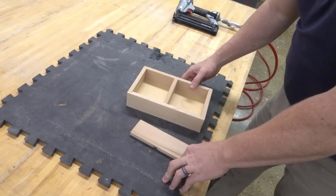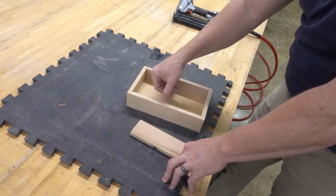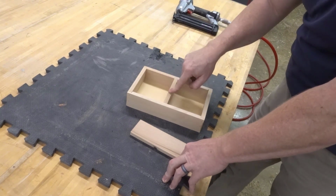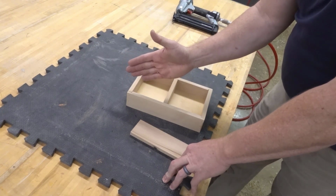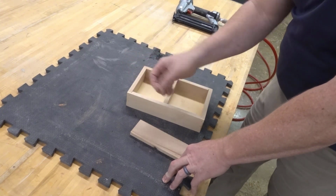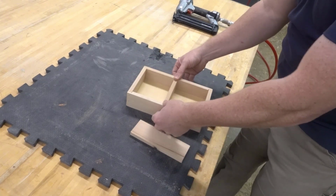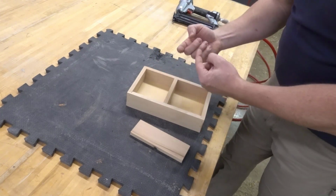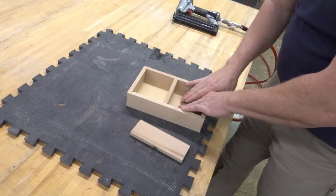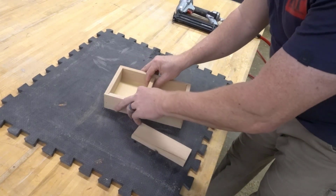The last one I built, the original, I cut it too tall. So if that happens and you feel a big bump here, you see that this is too tall, go back to the table saw, move it in just a little, maybe a 16th, maybe a 32nd, just very little, and cut again until this is really flat, nice and smooth. We're going to sand the whole top, and I don't want this one to stick out or be too low as we're sanding.